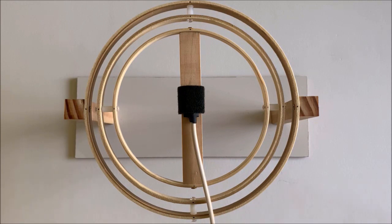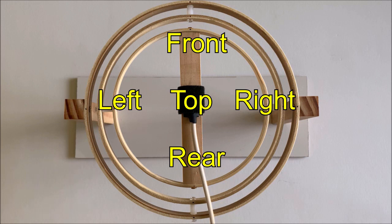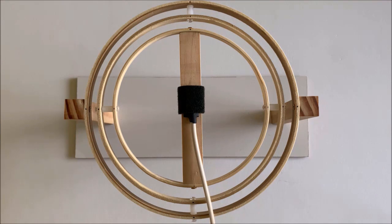The sensor has six sides: front, rear, left, right, top, and bottom. We need to point each side in the direction of the gravitational field and the magnetic field. There are 12 points in all, and we need to carefully search around each point while SARCTRAC collects calibration data. SARCTRAC beeps while it is collecting data. We have to move it around each point until SARCTRAC stops beeping.